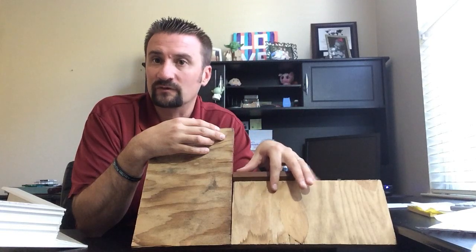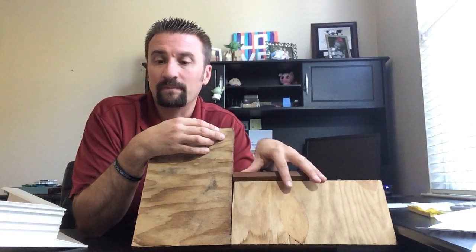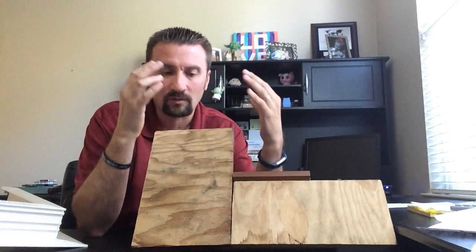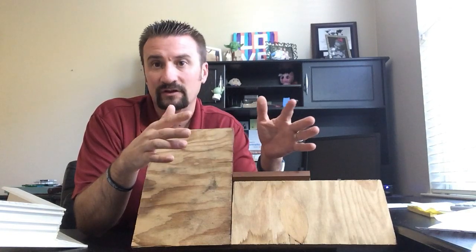In our community in Folsom, El Dorado Hills, there are a lot of stucco homes. Stucco homes can be very dangerous with a replacement window because the stucco is so porous. So the water is allowed to get into that stucco, come down the wall, and if you have any sort of house wrap or flashing issue around those windows, you can have leaks.